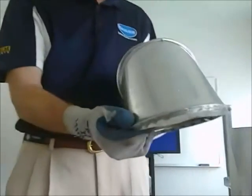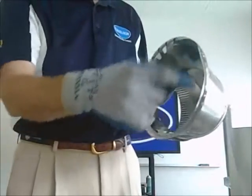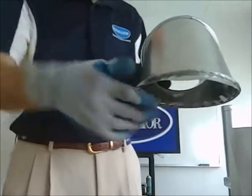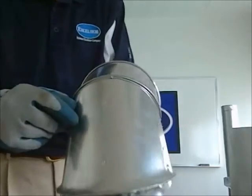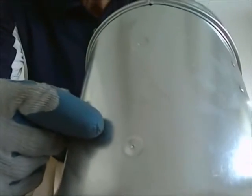Going back to the Scottie, sometimes it's very difficult. This circle here is not the same dimension on each side. It's not like having an elbow where you can just go around with the elbow, and sometimes on the top of the ductwork you can't see much up there. So what we've done is we put two dimples here. Let me show you right here. There's one dimple up there, and you can see another dimple down there.